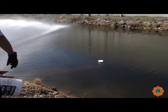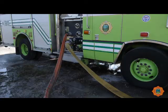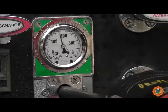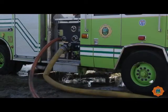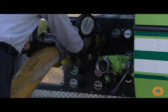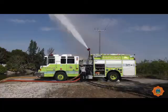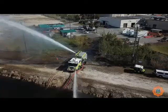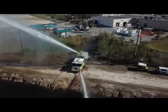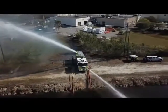After establishing a water supply from the first water jet eductor, lay out the second unit connecting the hose lines to the truck's officer side connections. Using the first unit as a supply, charge the second unit's 3-inch supply line. Once the second unit's 5-inch line has been bled free of air, slowly open its pump intake valve. Begin water supply operations by slowly opening the required discharge valves. Refer to your water jet eductor operation manual for additional information.